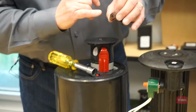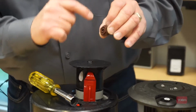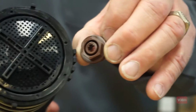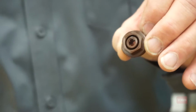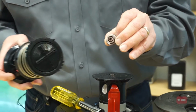All of our nozzles are color-coded and have debris stream straighteners in here that are debris tolerant. So basically anything that can get through the riser screen that's on the bottom of the riser can pass through any of the openings above that. So there are no openings smaller than what we would have in the riser screen.